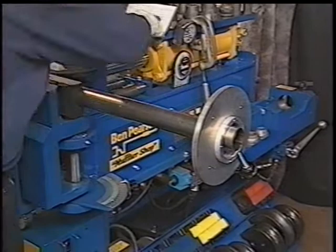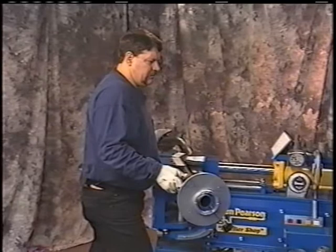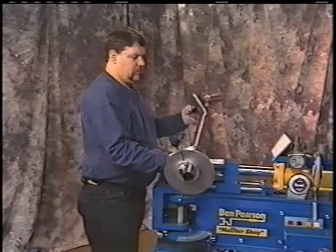All right, it says that our depth is 27 degrees. We'll go ahead and set that on the outside dial again, that's your automatic. And we'll bend it to 27 degrees. It'll automatically come back. We can jog the machine, stop it. We see where our cut line's at because we've made the two marks across there, okay?